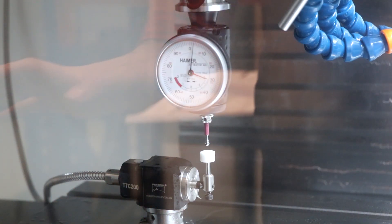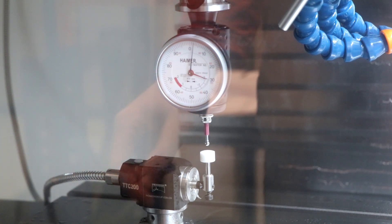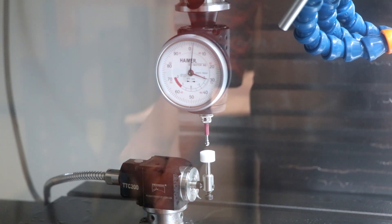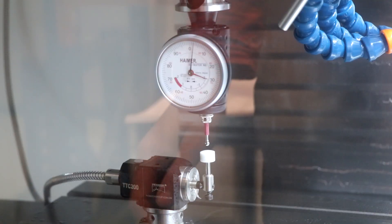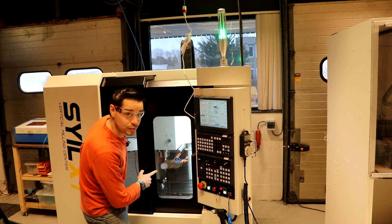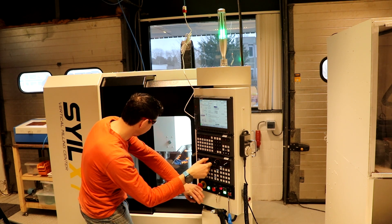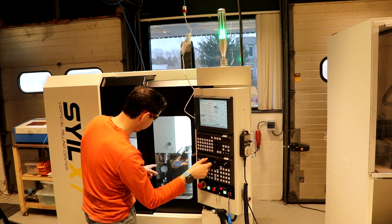I'm going to try to do a relative setup of my touch probe. It's a Pioneer TTC 200. I have an ATM menu in the controller and got the feed button completely turned down. I'm going to press ATM first and go for OK, while I'm holding my hands very closely on the emergency stop. I have my hand on the feed hold button and my other hand ready for the emergency stop.